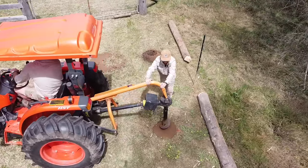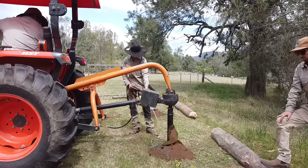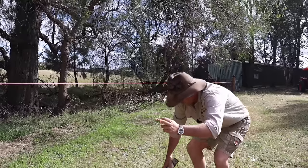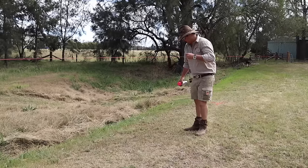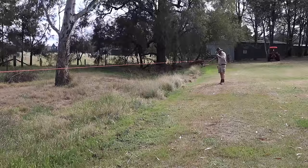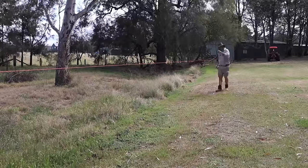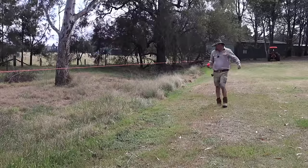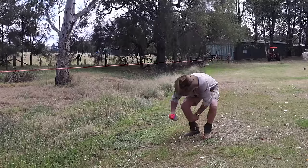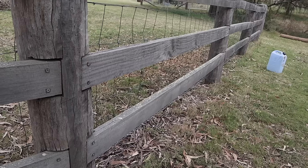That'll take a little bit more time but aesthetics is one of the key drivers of this fence line. The main thing with this one is it has to be aesthetically pleasing. I like to have a nice high string line because if your string line is too close to the ground your plumb bob tapers in and out a little bit more — plumb bobs are more accurate over distance. You do have to take into account wind loading; there's a slight breeze today but if you watch the line as the breeze hits it you can gauge that it's under 10 mil. This is going to be a post and rail display fence, so we're aiming as small as possible to miss as small as possible. Any take-up needed for deviations can happen in the boards when we put the rails on.